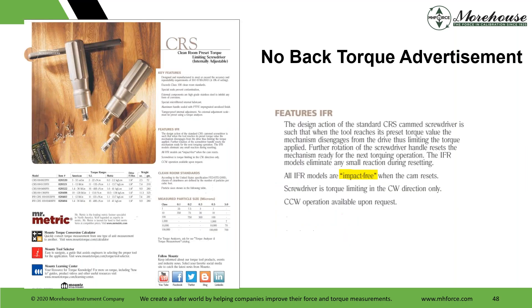This is an inherent design flaw. What can we do? You can look for it — you can ask manufacturers if their wrench has back torque. Some manufacturers actually acknowledge it. Look for the term 'impact free' when the cam resets, meaning it won't produce all that energy going backwards. You want to make sure whoever makes your torque wrenches does not do that. In the ATK situation, when they discovered it, they had records of everything, got rid of the bad wrenches, and had to go re-torque everything — spending around a million dollars torquing everything back down. They make missile systems, so we don't want loose fasteners — when we fire a missile, it needs to hit the target.